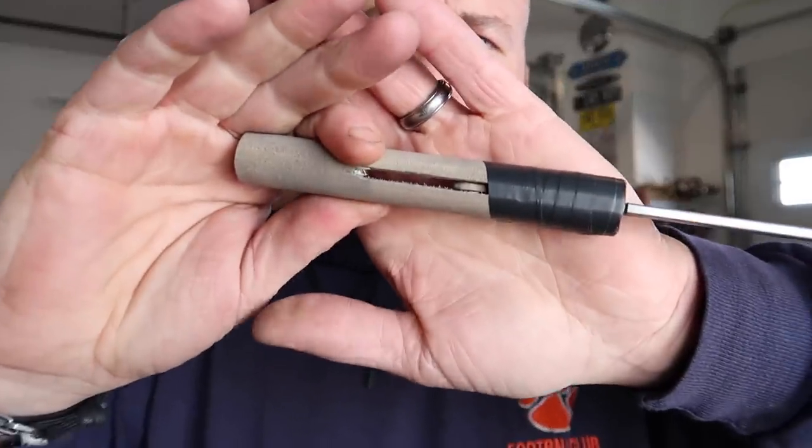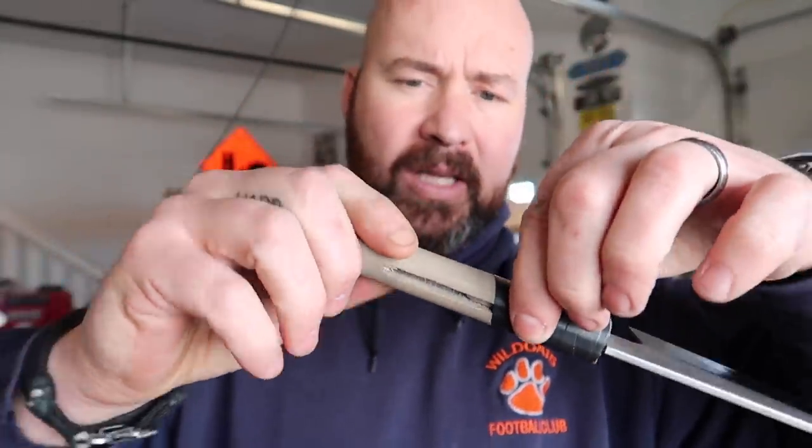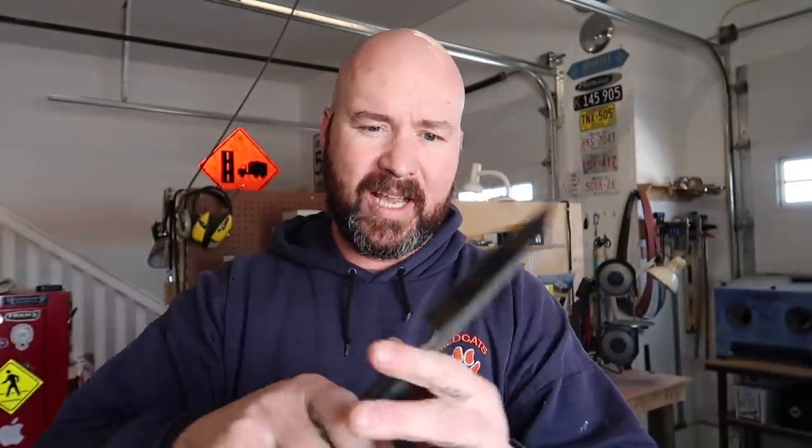The goal is to try and get as close to making a really fine cutting Japanese knife as possible, and being able to match a slimmer grind is definitely going to help to that end. You don't need that to make a really great kitchen knife, but the idea with kitchen knives is you want them ground as thin as possible. For a temporary handle I've just got a dowel with a slot milled in there and then I wrap electrical tape really tight to give me something to hold on to while I'm grinding.